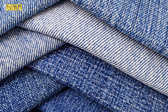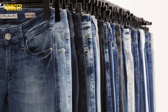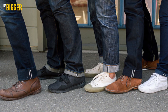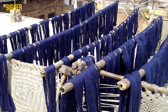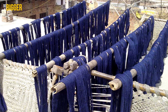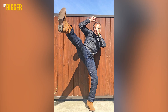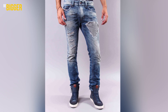This treatment firstly gives a more solid coloring of the fabric, and secondly gives equally spaced scuffs of approximately the same intensity across the entire batch of products. Washing then partially removes all these chemicals. This is unacceptable for selvedge denim — it's made of indigo-dyed but not washed fabric, and the ready items aren't subjected to any treatment other than the necessary minimum. Such denim is called raw, unlike the washed and treated fabric we are used to.